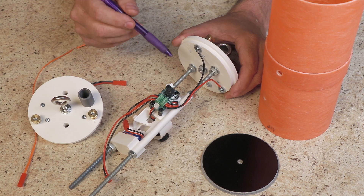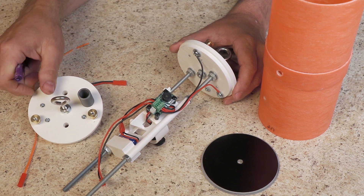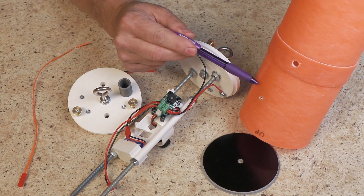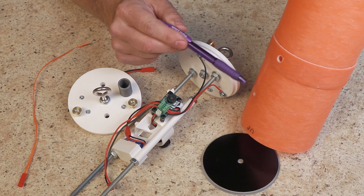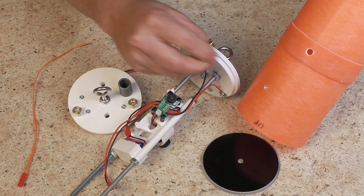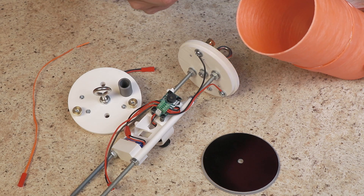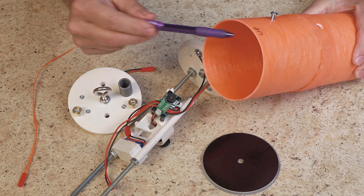So that's why I had a friend of mine, Jeremy — thank you Jeremy, great job — print these pieces for me. It's really convenient like this if I need to use it in another rocket. The kit does come with this coupler and the vent band, which I did use, and I attached them to the payload bay with 10-32 machine screws that just go through the payload bay and screw into there. On the other side I have a little bit of epoxy putty inside to capture the nut.